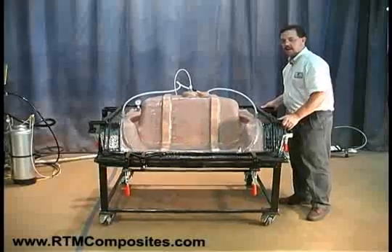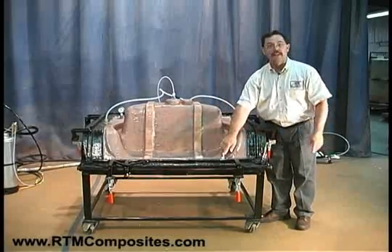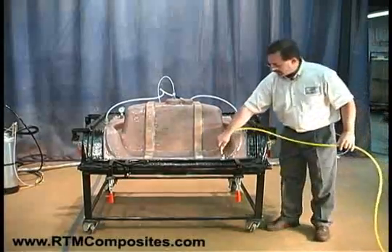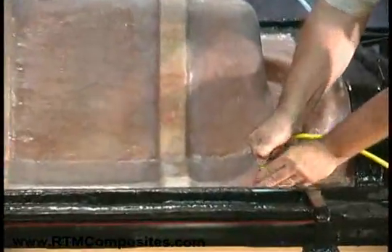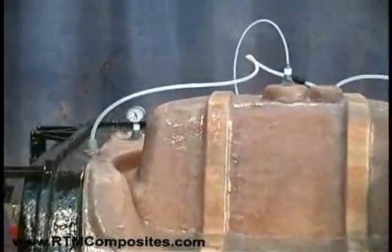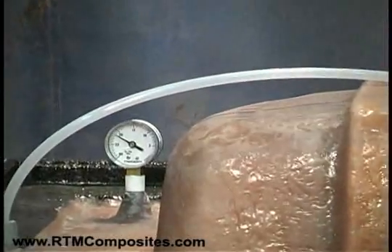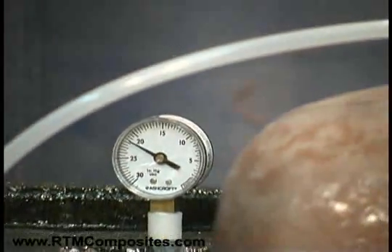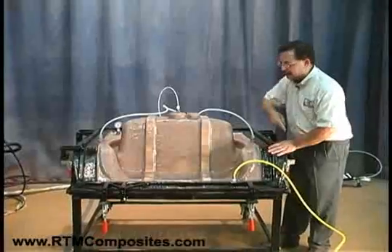The mold's ready. What we need to do next is hook up the flange vacuum — that full vacuum area around the perimeter of the mold. We're going to connect the 3/8ths or 10 millimeter line to it here; that'll be a yellow line. This yellow line is full vacuum — 10 millimeter vacuum — drawing around the perimeter. Go ahead and turn the vacuum on. You can see that gauge is pulling 23 inches. 23 inches is adequate; I'd like to see 29, but 23 inches is what we set it for in this illustration, and that's an adequate amount of flange clamping vacuum.